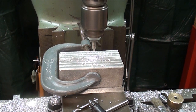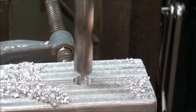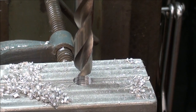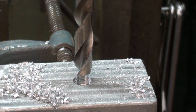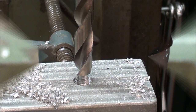Now I'll drill it a quarter inch all the way into the cavity. I just rough drilled the hole, three quarters of an inch, and now I am ready to go in with the boring bar. All of the finishing work up to size will be done with the boring bar. It's at about 7.50 right now, and I need to go to 8.50.